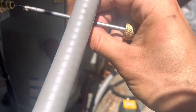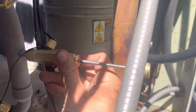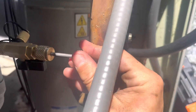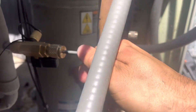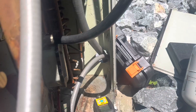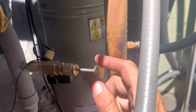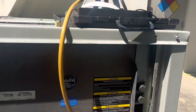Now I'm going to put this back in, push it, and tighten it on — it's kind of hard to do with one hand. Push, open, squeeze, and keep constant pressure. Keep it constant and then you'll feel it tighten. The reason you want to add a positive pressure is so that if you do this wrong you don't have to start the vacuum over — it's just a safety precaution to avoid wasting time.